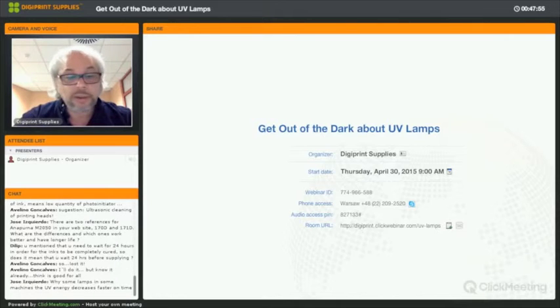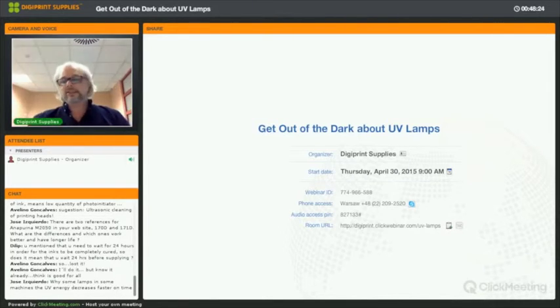Yeah, Dilip. If you printed something on your UV printer, like I said, it's dry for 85%, but the complete curing is only after 24 hours. So if your customer needs what you printed fast, it's okay to give it to them. Except in certain cases, like when you print on corrugated plastic, for instance, it might be that when it comes out of the printer, the scratch resistance and the adhesion is not optimal yet. So you can still scratch it off when it comes directly out of the printer, but 24 hours later you can't. But if you print on vinyl or on banner with your UV printer, no, ship it to the customer. You don't need to wait the full 24 hours to do that. Just be aware that for some substrates and image as well, because that will determine how thick the layer of ink is, that 24 hours might be what you need to get the curing that you want.